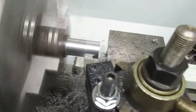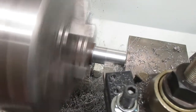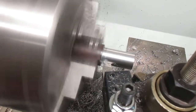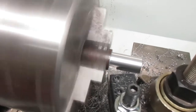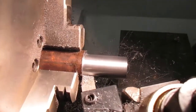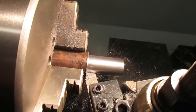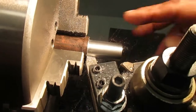That's really nice — 1018. Let's get a light back over it. You're really not going to get much better than that. Plus, you're not using these stupid shear tools where you can only take off a tiny amount at a time. I mean, you can actually work with this thing if you're turning the diameter.